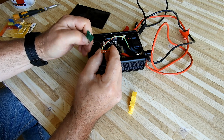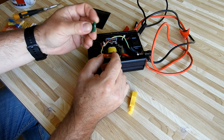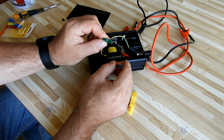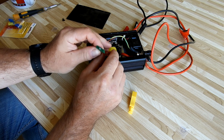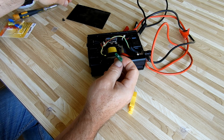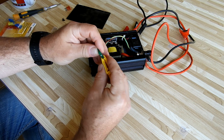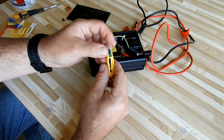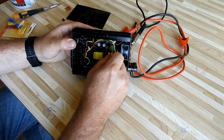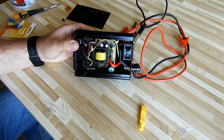This is a 40 amp fuse — that's what it came with, marked with a 40. I found a 30 amp fuse, and a 30 amp will work just fine here. You could probably go down to a 20 amp if you wanted to, but all I had was a 30 amp, so I'm going to put that in. To put it back, use the same plastic fuse puller device, hook the fuse in, and insert it back into position.